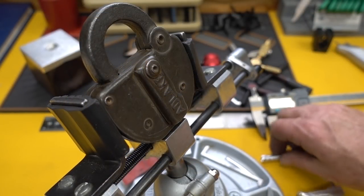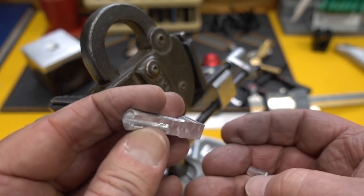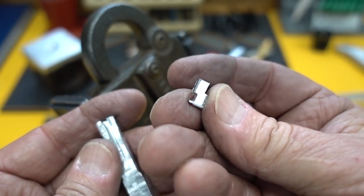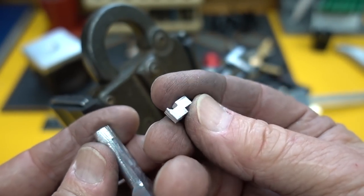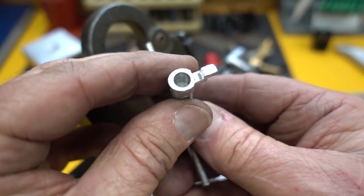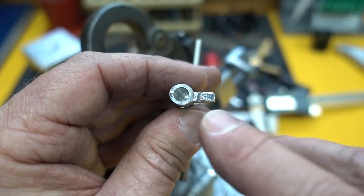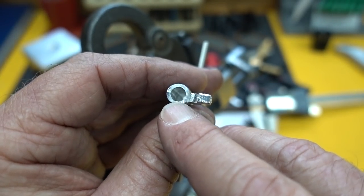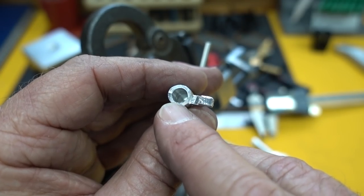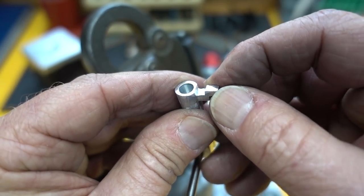This turned out to be the perfect project for times when you have plenty of time, like during this shutdown — this has taken all day. This is the third prototype, and of course it keeps breaking off near the tip. I had a couple of them break off inside and had to shake them out. What I've done on this latest one is reduced the diameter of that counterbore a little bit — it still fits, just a little tight. But I had to do that to leave the walls thick enough to support this tip. I'm hoping this one does not break off.